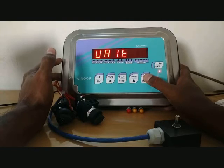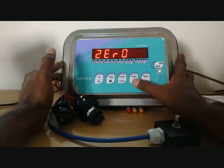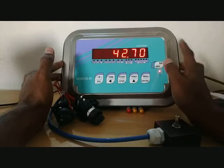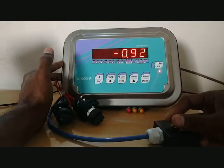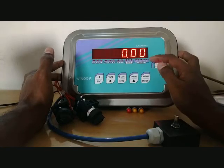Press enter. Then you have to perform calibration — select 0 and press menu. Now the default value is set. Make the pot to very minimum, then press menu for zeroing calibration. It is still in calibration mode.